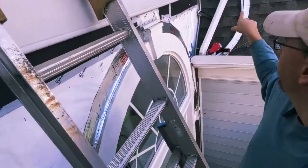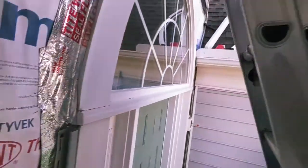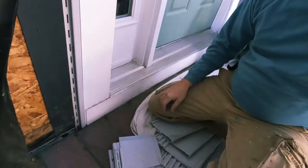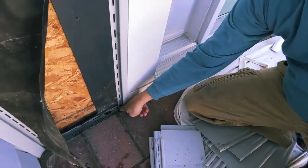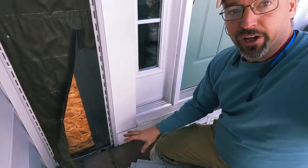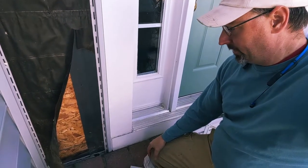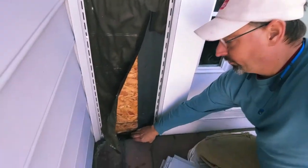We've got J-channel that's curved here, and they've got their curved aluminum trim on the other side. The issue we found is that when that curved aluminum trim came down, it ended up behind the J-channel instead of in front of it. And when you follow that J-channel all the way to the bottom, it's pumping all the water that hits the siding straight down into the bottom where the last piece of J-channel is. The homeowners told us the paver patio was glued down right on top of the existing cement stoop without taking any of the siding apart — landscapers aren't exterior guys. So now they've got this void, this funnel back here.